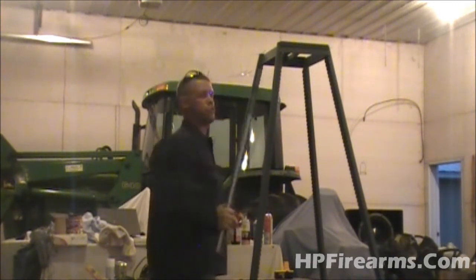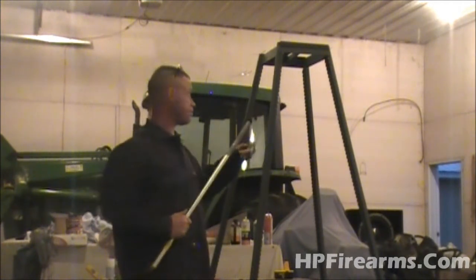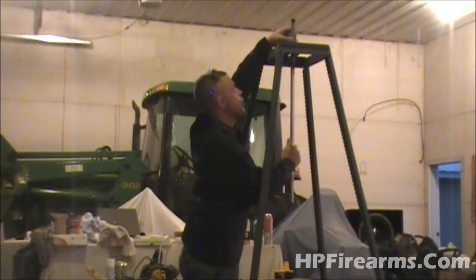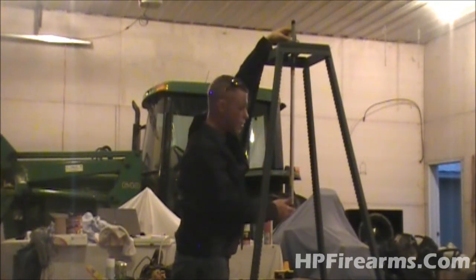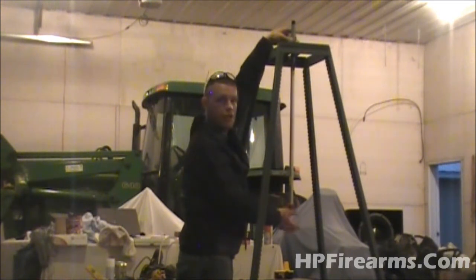What I'm going to be doing is I'm going to be using this half-inch galvanized pipe and a steel washer. I'm going to go right up through this and then bring our washer down over top, and we're going to weld that washer. We're going to leave this section of pipe on and let it hang down. Later we're going to make a battery box to attach on the bottom, and we'll run our charging cables inside this pipe so that as the windmill spins, the battery, the wiring, and everything will spin in unison with it so that it doesn't get tangled up.